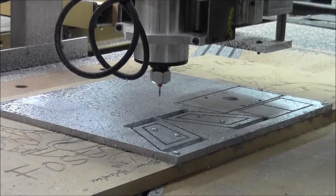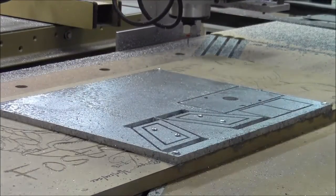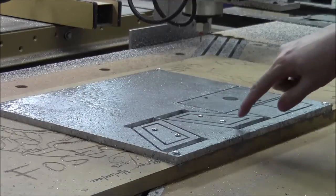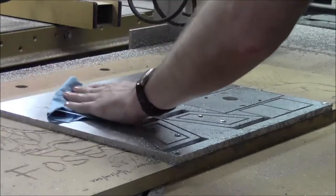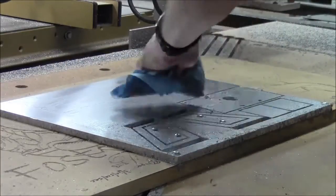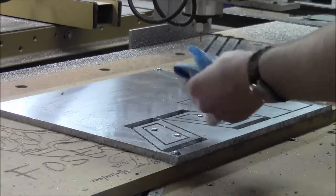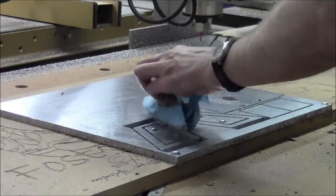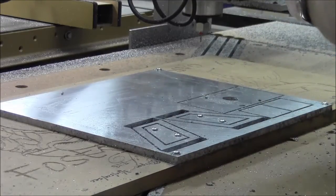The profile cuts came out. They're done. It is a big mess, but the cuts were successful. I had a few spots where in these really deep slotting operations, the aluminum likes to get sticky to the bit, and it was getting caught on the cutter and holding it up. So it was kind of jamming a little bit, but it was easily remedied with, in fact, you can see some of that stuff right there where it's a mess. WD-40, just spray some of that in there and all of a sudden everything's fine again.